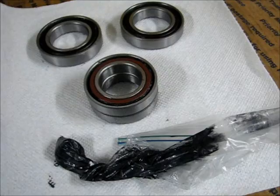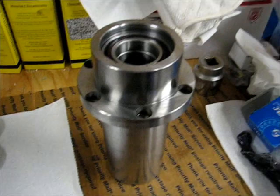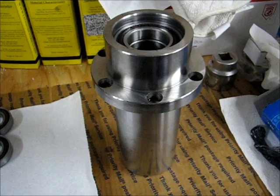Alright, I'm halfway through the process right now. I got the housing to 210 degrees, measured to 205 with my infrared non-contact pyrometer, but the emissivity setting, of course, is random. Steel is ridiculous. Anything polished with a shiny surface, you can't get the emissivity on. So I'm about to flip it over and put the top bearings in.